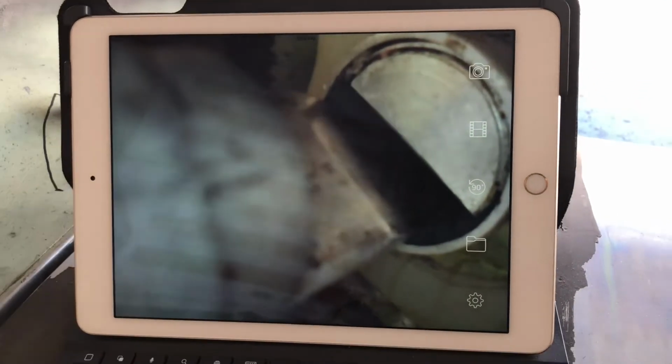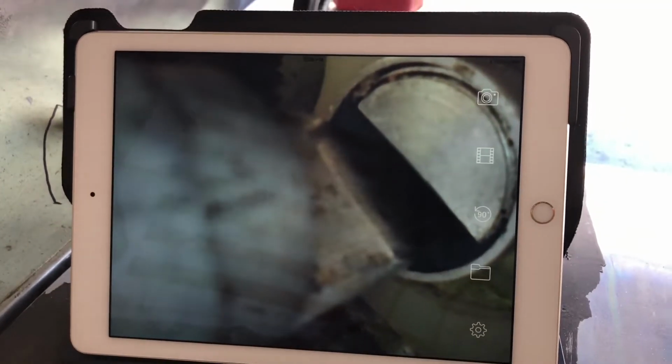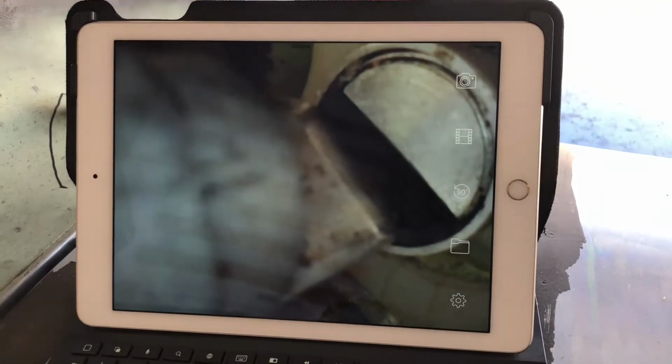We have to get that other pin aligned with the bushing, and then I like being able to use this borescope because I can actually see, am I going to align correctly when that aileron goes sliding in there? Do I have everything set correctly so that all the controls will work correctly once they're installed? Well, we now have a right wing installed.